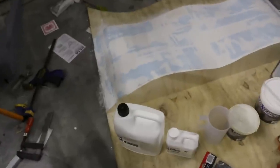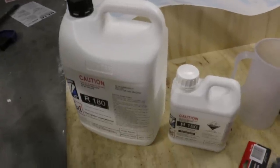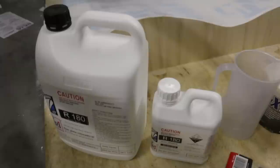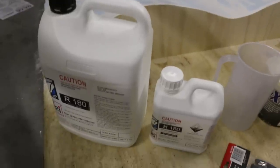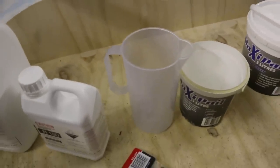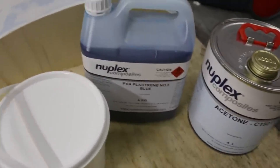To make the fiberglass you'll need some resin. I'm using an epoxy because it doesn't react with foam. I'm also using a standard hardener which gives an intermediate cure time of about 20 minutes, which is good for simple geometry. For more complex geometry you probably want a slower cure time. You'll also need a measuring jug and possibly a set of scales, some mixing cups, and some PVA.